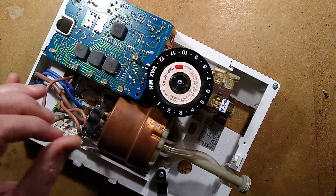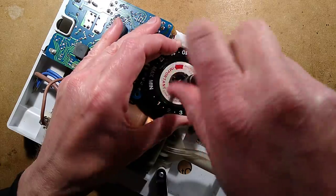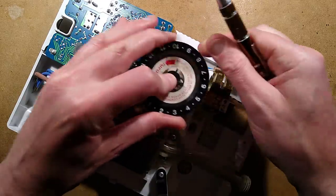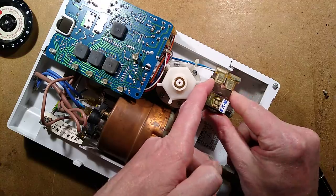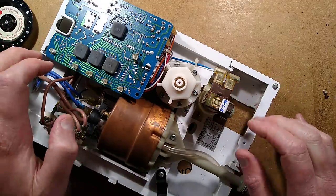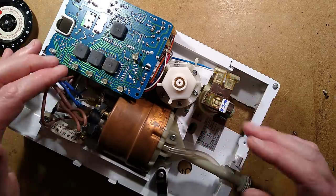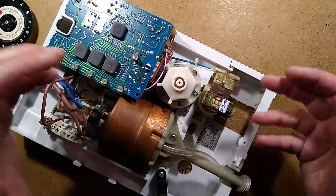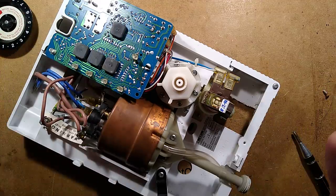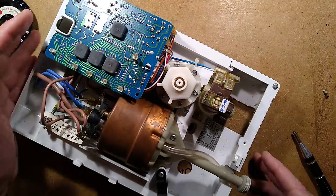The first thing I'm going to take out is the dial, which is the bit that regulates the flow of water through the unit. We have this solenoid valve, and it's notable that as soon as this started happening, Ralph pressed the stop button. There's an annoying delay — it's a cool-down feature — so the water didn't stop immediately. But as he stepped out the bath, it suddenly cut off, the solenoid kicked in, and the water stopped flooding out the unit.